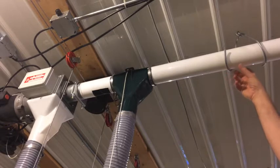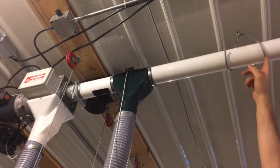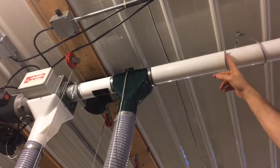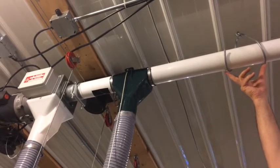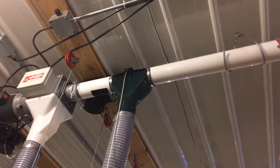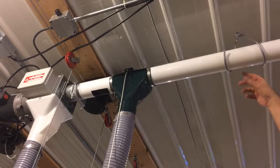We're doing a video overview of our fill system on the inside of the building. We've got a 3.5-inch PVC line coming in as a feed line. We're showing it with the formed hangers for support, which would generally be on a 4-foot or 5-foot center. These could also be a chain and S-hook arrangement to properly support that line coming in.